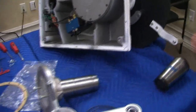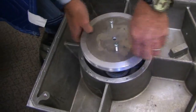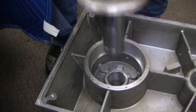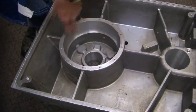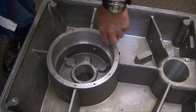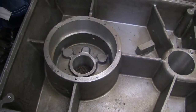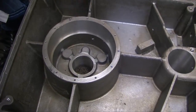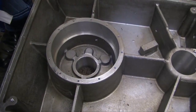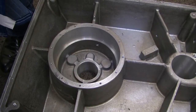We're going to go back into here now, and now we've pulled the piston out by using our pullers. You pull it out, and now you've got everything exposed. You've got the wall here. You can see where the grease disappears. You may see black from the O-ring wearing out, mixed with the grease if there's any left. You have to clean the surface with whatever mineral spirit solvent you have to clean that out.